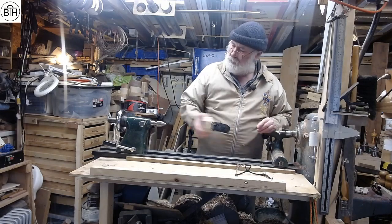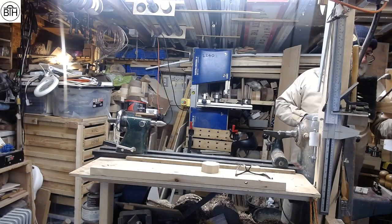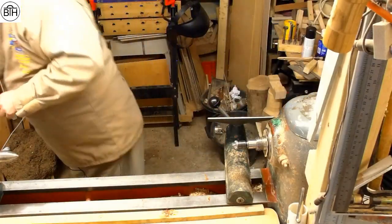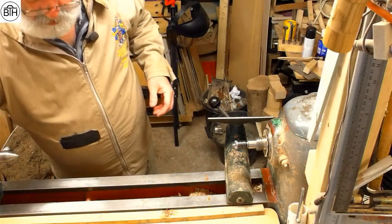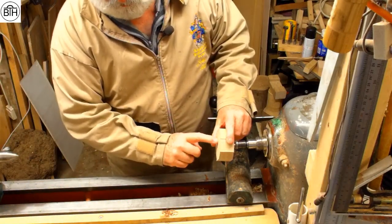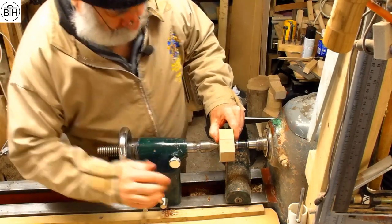What I'm going to do is mount it between centers, and I'm going to turn it with a bowl gouge. The reason I'm going to turn it with a bowl gouge is because it's the same orientation as a bowl would be. So therefore, what I'm saying is the grain is going this way. So I bring the tailstock up, pop it in place,